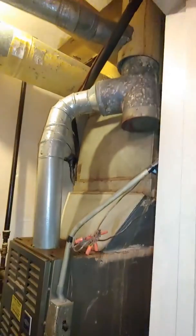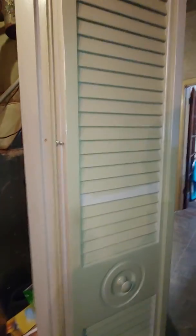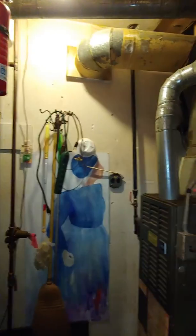Everything will be accessible from the attic and in here — and when I say attic, it's just a little floor up there. So we'll run a condensate pump, line set, coil, furnace, and 5-inch media cabinet. In terms of combustion air, we're good because we've got louvered doors. So that should be everything.